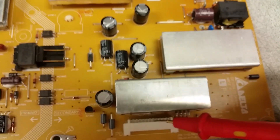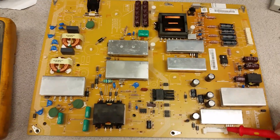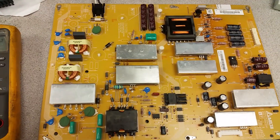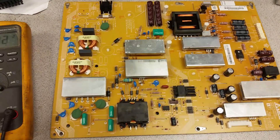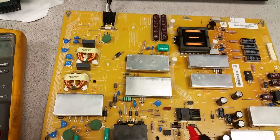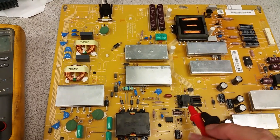Just as this table says, on pin 15 there is 5 volts — this is the standby voltage. This is the voltage needed for the TV to operate at the bare minimum, waiting for your input to power it on, whether by a button or by remote control. Very little power is needed for that.